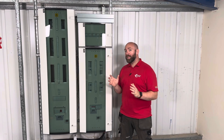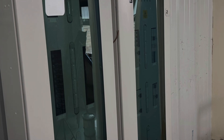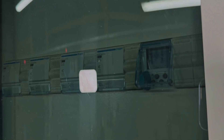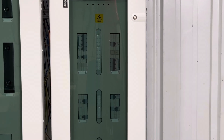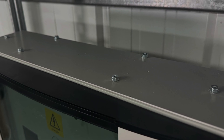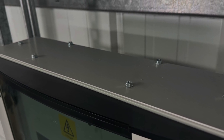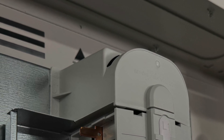So what have we got? Firstly, we have what I think makes a Hager board a Hager, and that's this curved glazed door. It's always easy to look into the distribution board to see what, if any, circuits have tripped — and they look really nice. Up on the top of the board we have these removal plates, top and bottom, and the cutouts are designed for trunking, so you won't need to pack out your trunking at the back to get it to meet the cutouts.